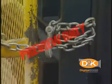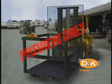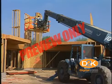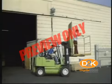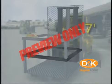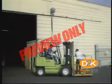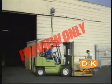The safety platform must be firmly secured to the lifting carriage and/or forks. Means shall be provided whereby personnel on the platform can shut off power to the truck — though if there is a forklift operator, this requirement is not necessary. Generally, a safety platform used to lift people on the forks must have a 42-inch high guardrail, a midrail, and a safety barricade or screen that is 7 feet high. This screen prevents the person elevated from getting hands caught in the mast during elevation or lowering.